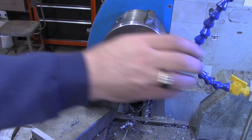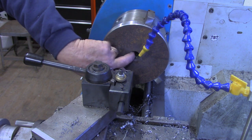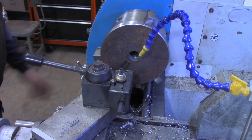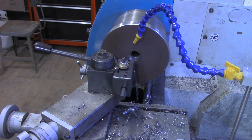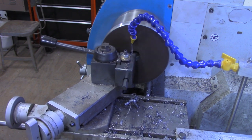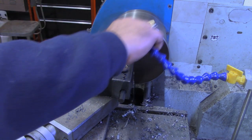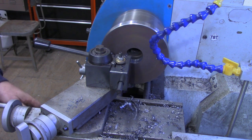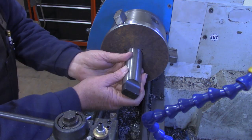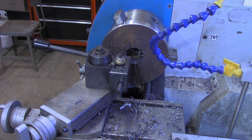The boring bar is set up now. I've taken a measurement on that — I made a couple of passes with the boring bar and cleaned it up, took a measurement, plugged it into the DRO. So it should be ready to go now. We've got about 700 thousandths to go. I'll bring you back when we get a little closer. I know you can't see anything right now with the coolant. All right, I think we're about ready to do our final pass now. One more pass to make, then we'll check it and make a spring cut. All right, that clears fine — that's exactly what we're looking for. I'll just make a spring cut and clean it up.